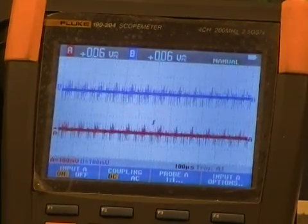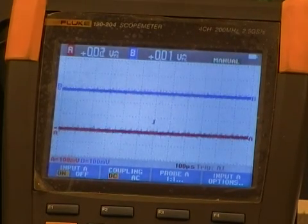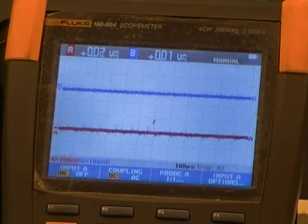I'm now going to un-shunt this and hook up a shaft grounding brush. There's still no change. Shaft grounding systems do not affect high frequency current on your ground wire or on your common mode leads.